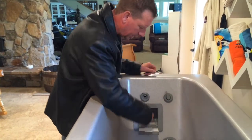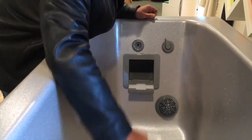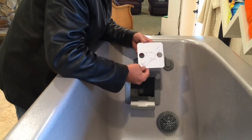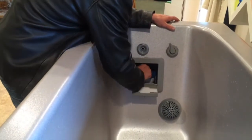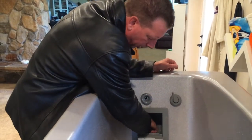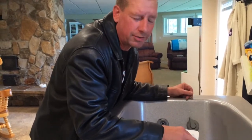The filter is located inside of here. Lift this basket up — 90 degree turn towards you and it lifts out. There's a little top piece onto the filter with an adjustment. Always leave this wide open so as much flow as possible can come through the filter. We recommend changing the filter every month for regular use, and regardless every three months if it's not used that much.